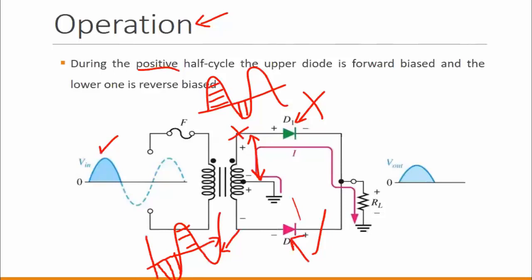If you do one, it looks like this. Remember, this is a full wave rectifier. How does the output signal of a full wave rectifier look like? Is it the same as in half wave? So you got a different circuit, right? The outcome signal shape is definitely going to be something like this, right? So to achieve that, this is one type of circuit. If you take away one diode altogether, then that would be what? So it's not going to be full wave.